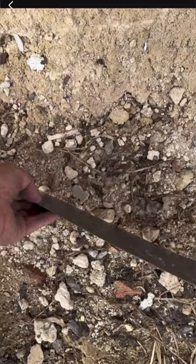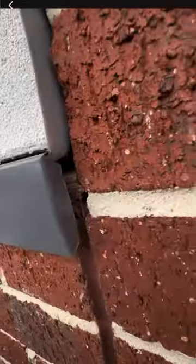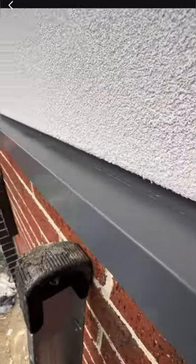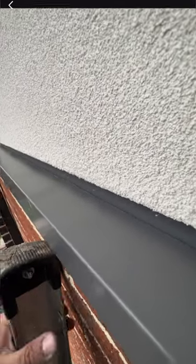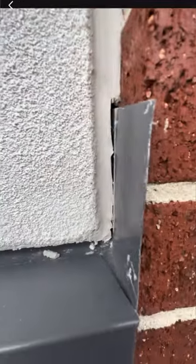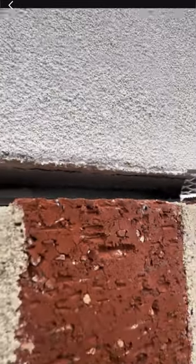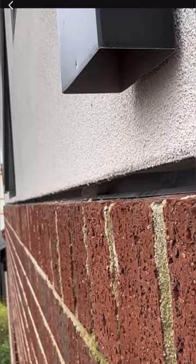See this piece of flashing right here — let's see why it's been cut like this. They've joined this flashing in an inadequate way to another flashing. Water is definitely entering this section of the wall. Check out this pressure flashing — so these guys used an external angle to finish off the bottom of the wall, the bottom of this polystyrene cladding. Look at the way they finished it — this is common throughout the whole section of the wall.